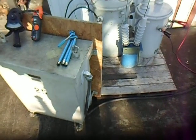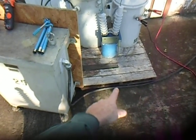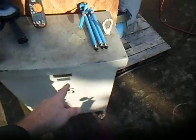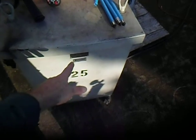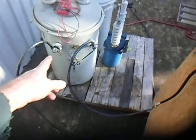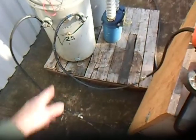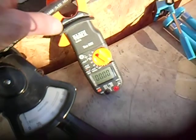All right, truth and wisdom seekers. What we're going to do today is take the output of the McCulloch generator, which is going into this dry step-up transformer that can step up from 120 all the way to 240 to 480 — supposedly rated for 25 kilowatts. We have a matching 25-kilowatt pole transformer over here, and a couple of clamp-on amp meters: an old analog one and a nice new digital one.